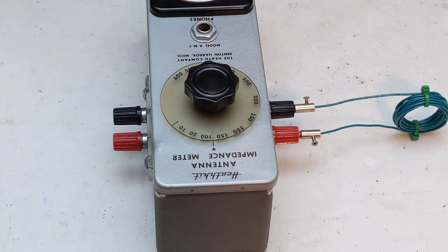As well as using a resistance substitution box, I tried the unit with my HF and VHF amateur radio antennas and saw a dip around the expected antenna impedance at the frequencies the antennas were designed for.